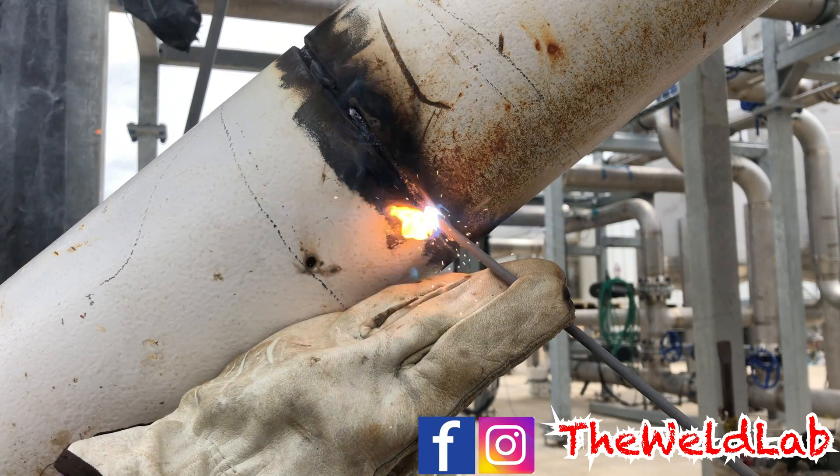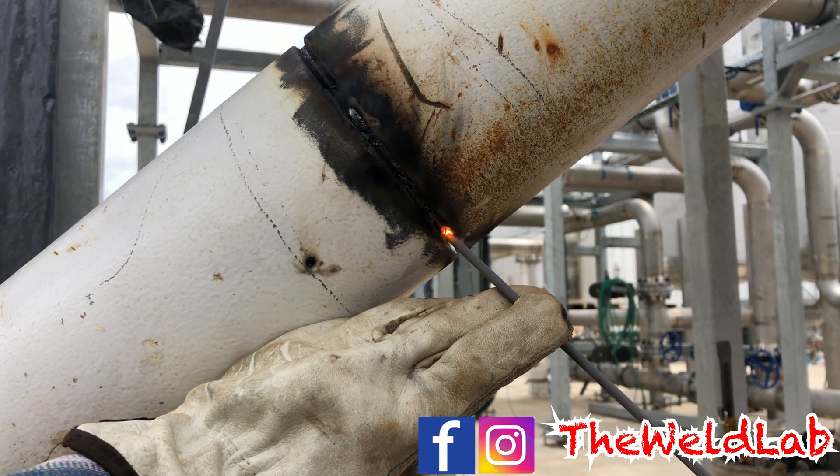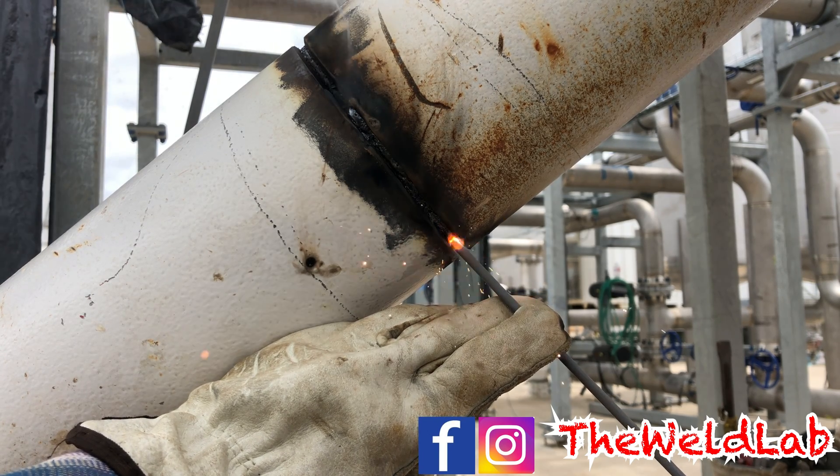When you do your tie-in, a good tip is to use two fingers to keep it steady, because sometimes you do have to whip it back in if the keyhole gets too big, and having two fingers on the rod will help you out a lot.